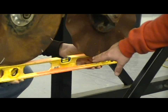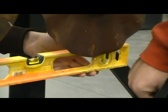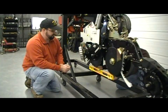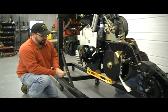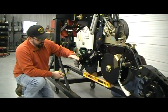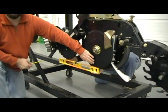So in this case we would be creating a false bottom in the seed trench and we could have problems with consistent planting depth. Here we're going to check the coulter depth in relationship to the disc openers, this time on this Great Plains unit, which happens to be set more closely to correct. Again we've got our toolbar leveled, so we know our row unit itself should be leveled.